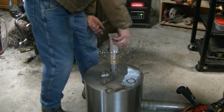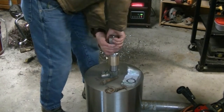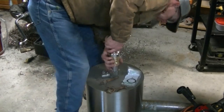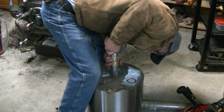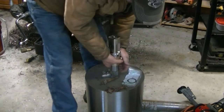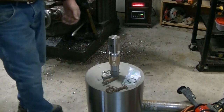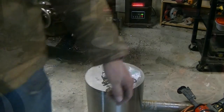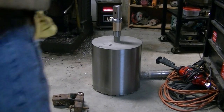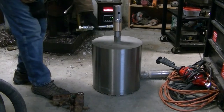The material I made the spindle out of is 17-4 stainless steel. I found it at the local scrap, it's a freight damage place, but they occasionally have stock metals. If a magnet sticks to it, it's 50 cents a pound, no matter what it is. But I found a couple chunks of this stuff out there. It machines beautifully for stainless steel and has held up real well over use.